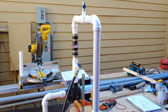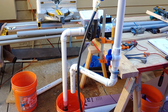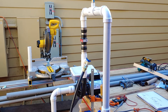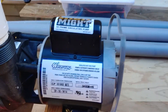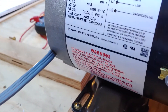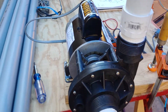Hello YouTube! I haven't made a video in a long time, but now I'm ready to talk about pumps. This setup is going to show that you can use a centrifugal pump that specifically says 'mount under the water level' to pump water up against gravity. We're talking about a waterway recirculation pump — 1/15th horsepower, 1/8th horsepower — and it pulls 1.6 amps. The manual says you have to mount it below the water because it's non-self-priming.